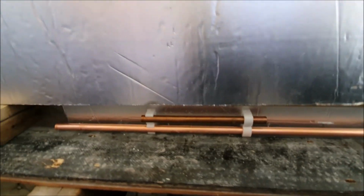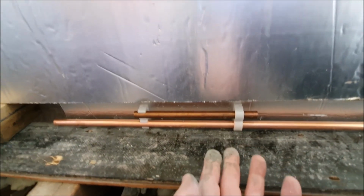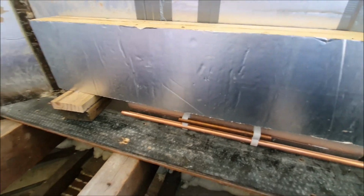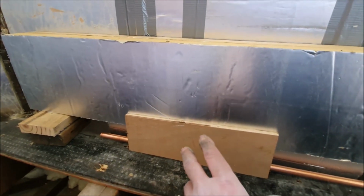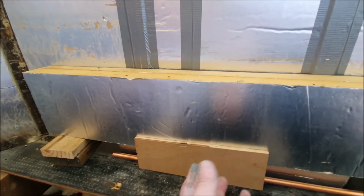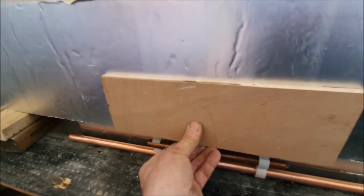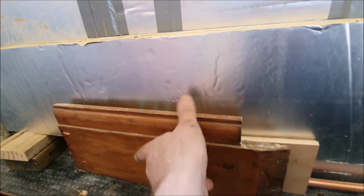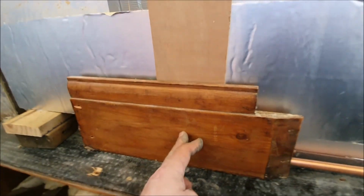So what you'll see is that the pipes are actually insulated at the back, and it's running above floorboard level with 80mm of insulation here, and then on top of that is going to be 12mm of plywood, which I'm fastening through the insulation. I'll possibly still have the pipes visible at that point, and then the skirting board can fit onto that. So either way, I've got enough room for the skirting board.